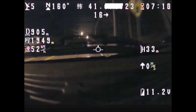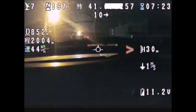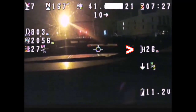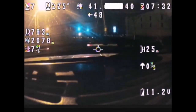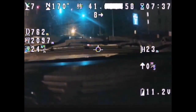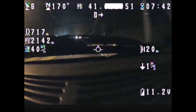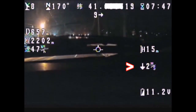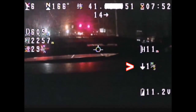Below the timer, when you see the letter H, that's the height indicator or the altitude indicator. It works in meters — it's metric — and it tells you how high the aircraft is flying. It works in combination with the OSD and a barometer that comes with the OSD to give you a more accurate description of the altitude. Below that, that's the indicator that tells you how fast you are climbing or decreasing altitude in meters per second.